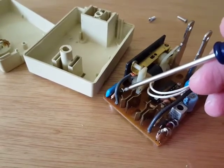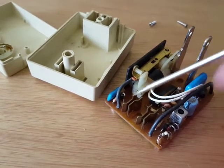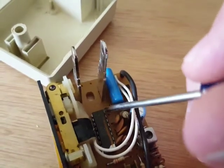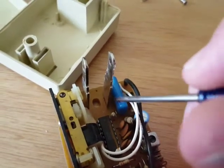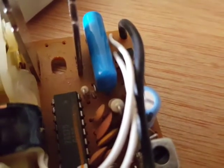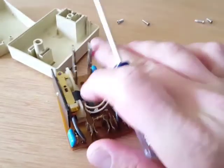One of them is this diode right here — you see that silver wire — the diode is a black cylindrical thing with a gray stripe on it; that needs to be cut and separated a little bit. Then there's a jumper, which is just a wire connecting two things right in there. That little tiny jumper is what you want to cut and separate. So just those two things — three cuts on the lamp module, two cuts on the appliance module.